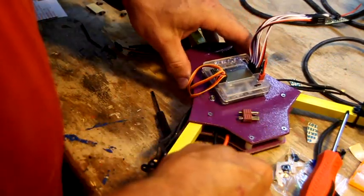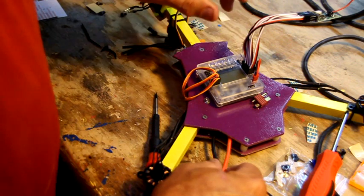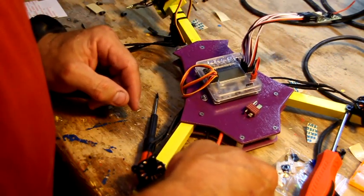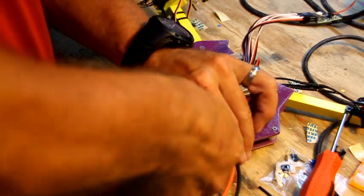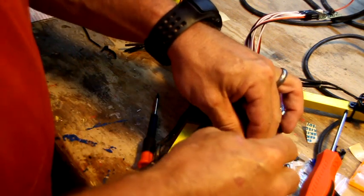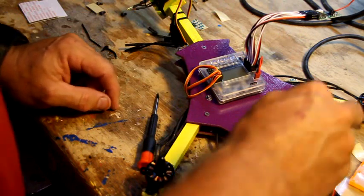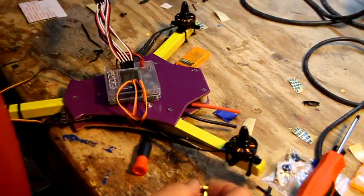So we're going to solder on the connector, and I'm going to kind of keep it short because I've been making them kind of long, and I got too much damn wire. So I'm going to cut it about here and hook my connectors up. Let me get it prepped up. You'll just cut a little bit of the silicone wire off this. You only need about a 1/4 inch showing, and we'll get a little helping hands, which is where the helping hands come in very handy.